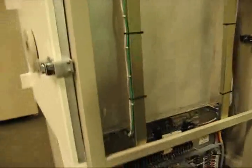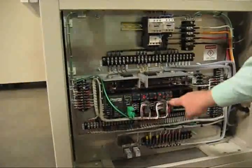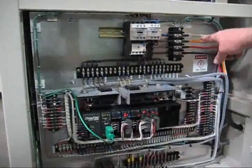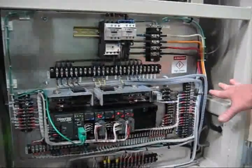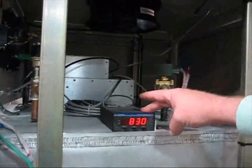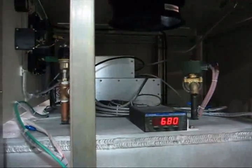You can come around here on the right-hand side. At the very bottom, you can see this is our PLC control, all of our nice neat wiring, and your main contactors. This is where your power is coming in — this particular unit is running on 208 three-phase. You can see it's very neat and tidy. Up above here, you can see one of the types of vacuum sensors we have. It's a thermocouple style, and that's the readout actually dropping down, and it also reads out on the front.